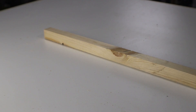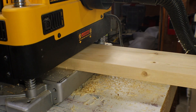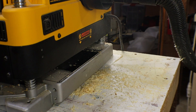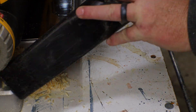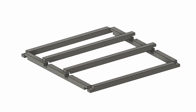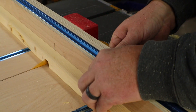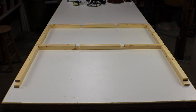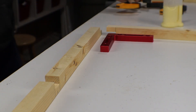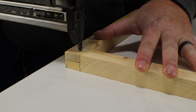Most of the lumber for this is going to be one by one, so I'm going to plane down some 2x4s to one inch thick. I'm going to make a platform from some 1x1 boards joined together with half-lap joints. I'll put the crosscut sled down and cut out some lap joints on the ends of these boards. With all my joints cut I can dry fit it all together and make sure it fits. It all seems to work well so I'm going to glue it up with the help of some positioning squares and clamps. I also added a couple of staples to really hold it all together.